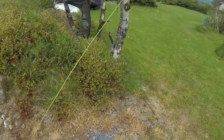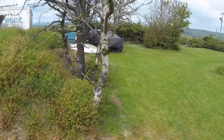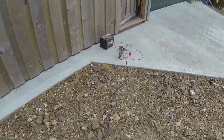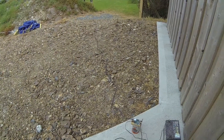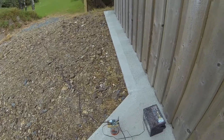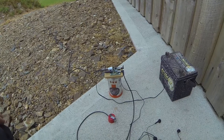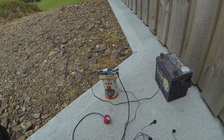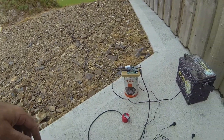This is just a general sort of setup really, and it's all going to fit into that can when it's not being used. The coax comes along here — just a random length I had — which is now all connected and soldered up in this joint, and then we've got an earth that goes down to a tent peg. Then this bit of scavenged wire out of a normal flat twin just disappears off there. I just need to test and cut the aerial wire to the right length for the frequency to get the SWR down, and check the circuit to see why the carrier sounds permanently on.